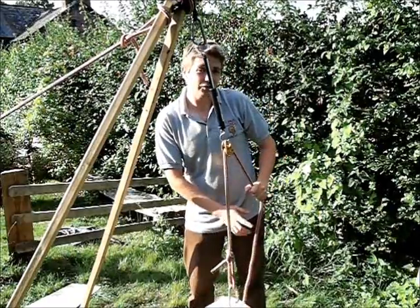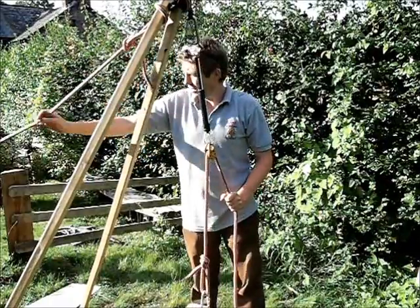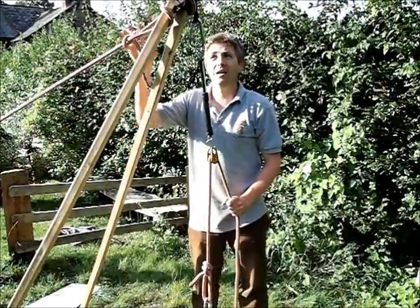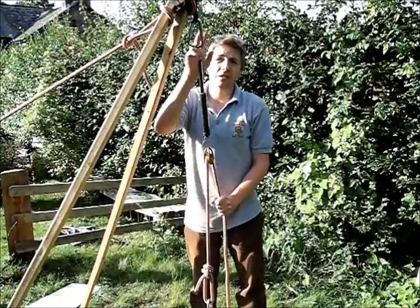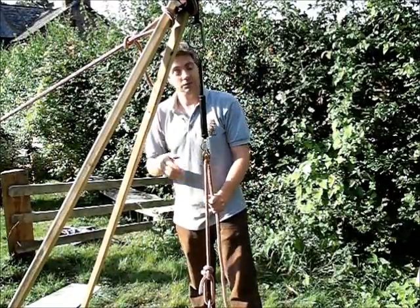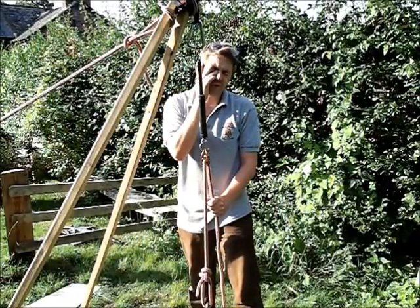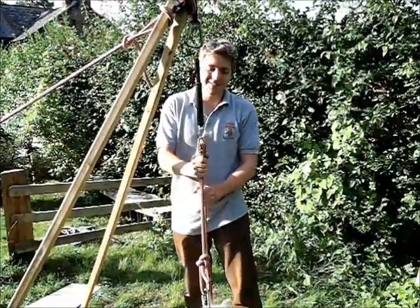So that's one thing to be very careful of: not pulling with vehicles from elsewhere, because you're doubling your chances of failure in your anchorage at the back, your line, and the framework. Using a chain hoist held right here and standing off to one side by operating the chain — that's really the most sensible and safe thing to do. Okay, goodnight. Thanks very much. Bye bye.